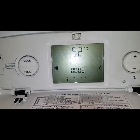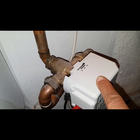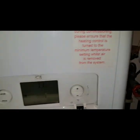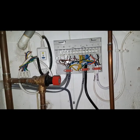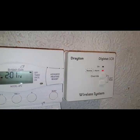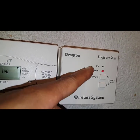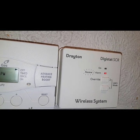So we've got voltage. The boiler's fired so we know it's working because we've got a flame, so we're getting hot water demand right now. You can see the mid-position valve is showing hot water. Pump's running. The burner's gone off at the moment — we'll just check if we're getting the voltage still. So I'm still getting the power. You can see the alarm light is on, and this is from the cylinder thermostat. But because the on light's not on, we really shouldn't be getting power sent down to that connection.